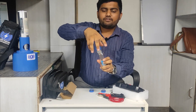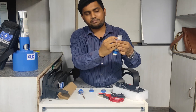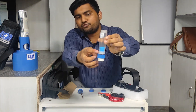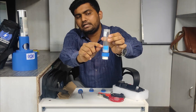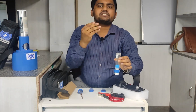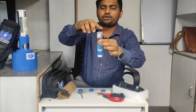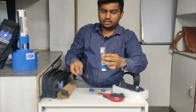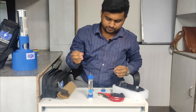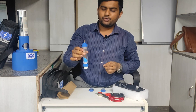This is the electrode. Before using the electrode, we have to open this part, and after opening it we will fill water completely up to the marking. We will fill the copper sulfate solution up to that part. There is no specific proportion suggested in IS 516, so we keep the copper sulfate powder up to one inch and then fill water up to the end portion.